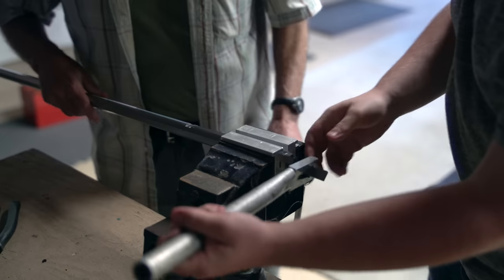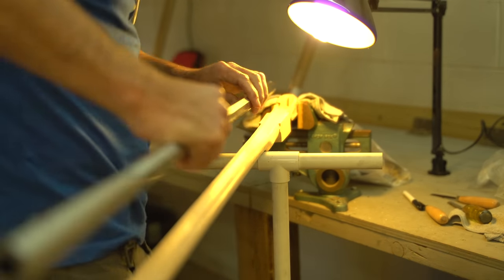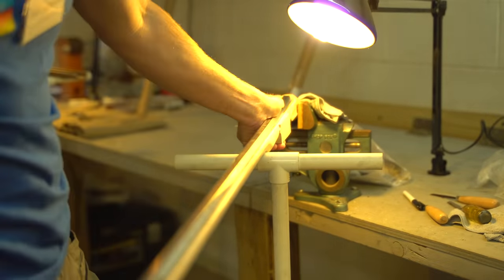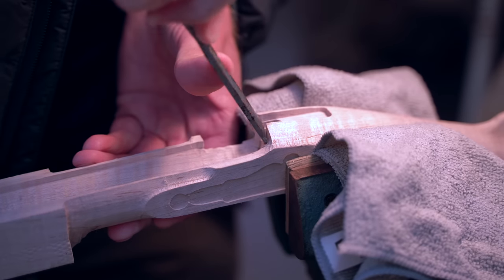That morning we got started. The first thing we did was remove the breech plug — basically lever that thing out of there; it's in there incredibly tight. Then came the tedious work: inletting the barrel. Making sure the barrel would sit down flat inside, removing little bits of wood at a time — essentially marking the barrel, dropping it in, seeing where the high points were, and coming back with a file to remove little bits of material until you finally get it inletted. Right then and there I was like, did I bite off more than I can chew? But rinse and repeat — remove little bits at a time, because you cannot add material back.